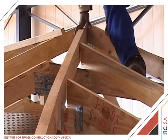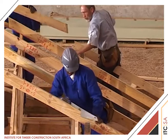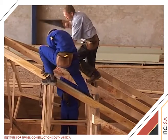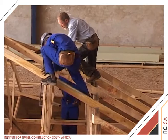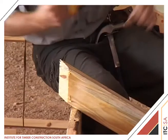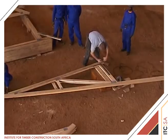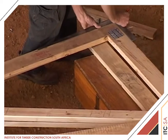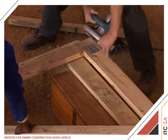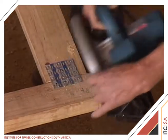The rafter of the hip girder is now fixed over this mark. The top cord of the first J1 will butt against the hip rafter and is cut at an angle of 45 degrees against the marked position. The rafter of the second J1 jacks are cut at 45 degrees along the chalk mark position at TT1. The top and bottom cords of the hip girders are now cut to length, the apex of the rafters cut to a 45-degree angle, and the extensions of the bottom cords cut from the centre line at 45 degrees on either side to fit snugly against the bracket on one face and the first J1 on the other.